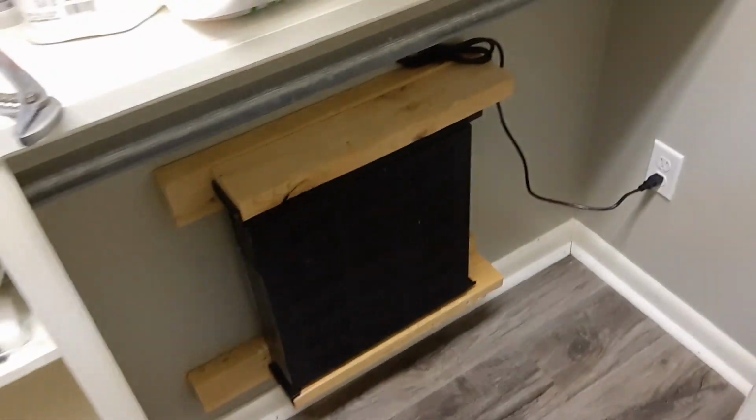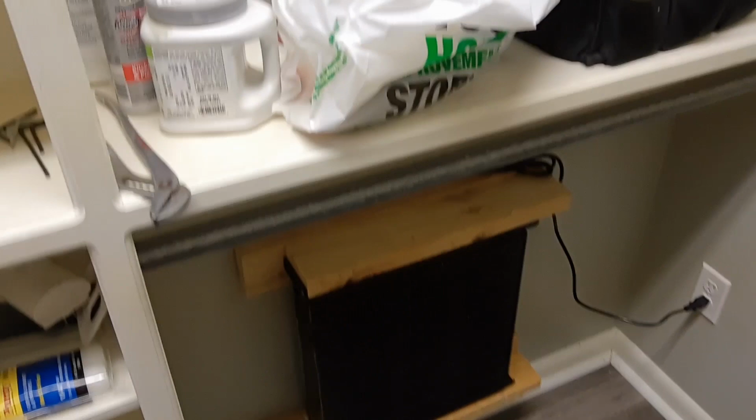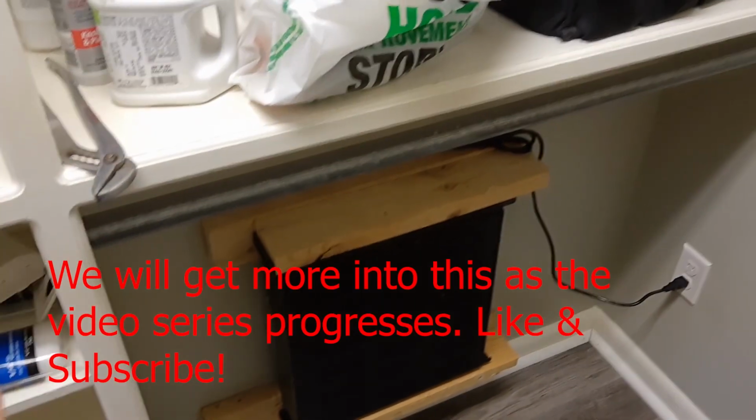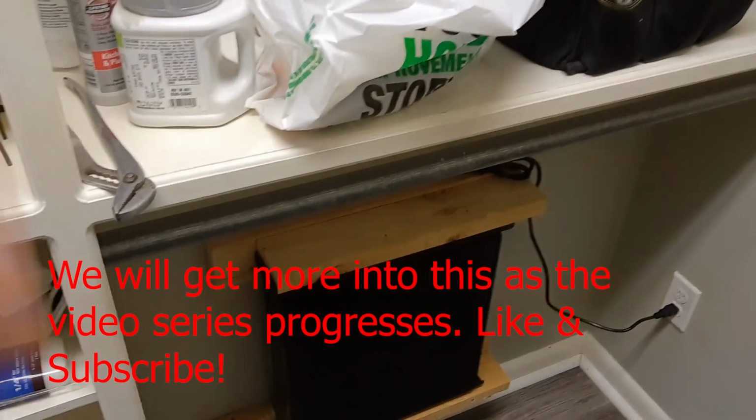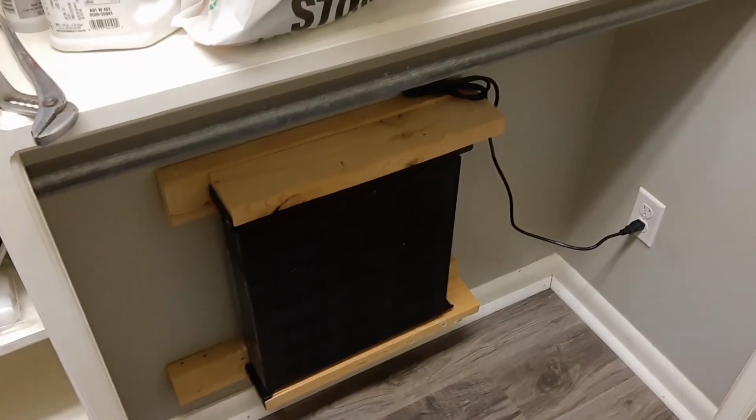And so we'll be running the wires from the attic down in the wall and then out of our access holes here. And then these 2 amplifiers have to be linked together because this will be a 6 source system. So both amplifiers will share the sources. So it'll be a 6 source and then up to a 12-zone system.